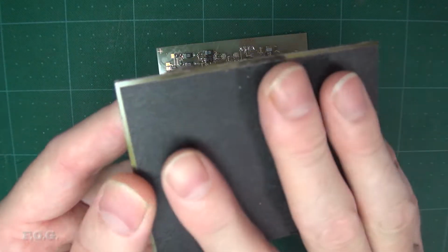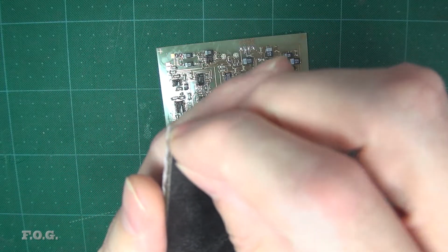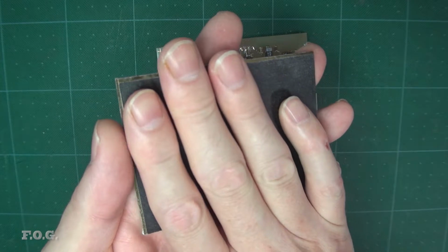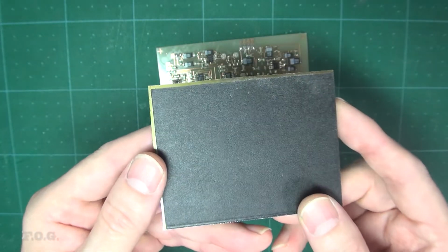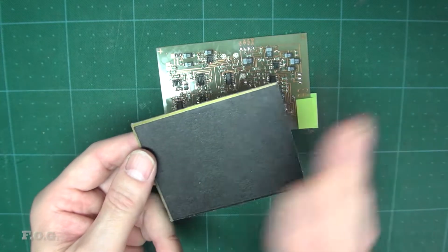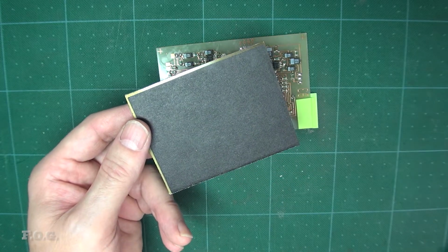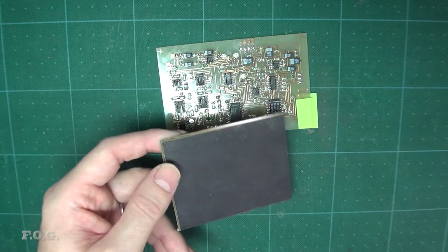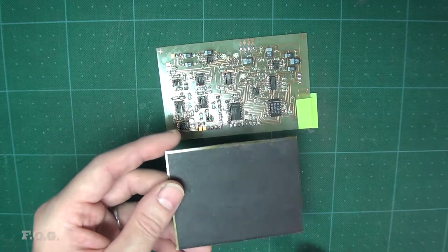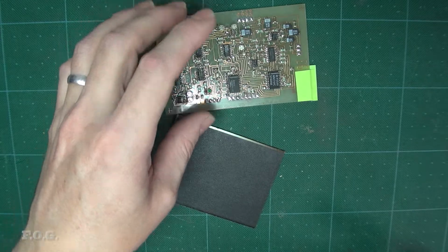And this black sheet here, you would go into the dark room, you'd take this sheet off, you'd put your positive resist on there, which is a transparency, and you would expose it to UV light for a certain amount of time, and then you put it into a chemical wash to wash off all of the unwanted resist surface, and then you put it into your ferric chloride etch or whatever your etchant was to remove the copper you didn't want, and that's pretty much the result.